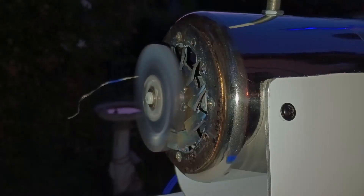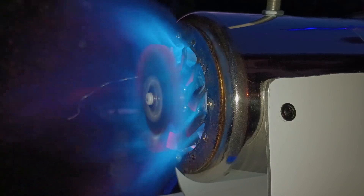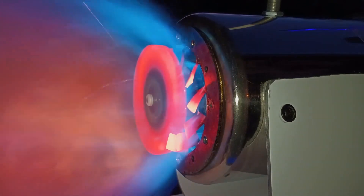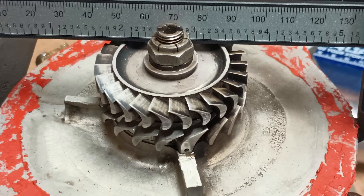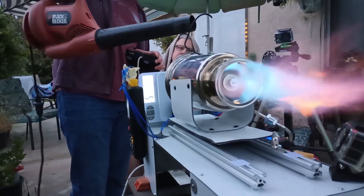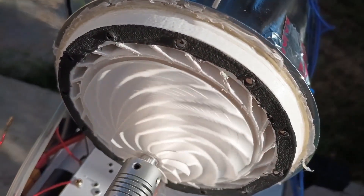Following these chronic failures, I removed the nozzle to check the turbine's performance, which allowed a glimpse into how the hot gases interacted with the stator and rotor. The turbine wheel appears to have too low of a pitch, and there seems to be an imbalance somewhere in the shaft coupler. The way I made the turbine wheel also didn't allow for cupped blades, which are ubiquitous in all turbomachinery. It's likely that one or a combination of these factors prevented this turbojet from starting properly.